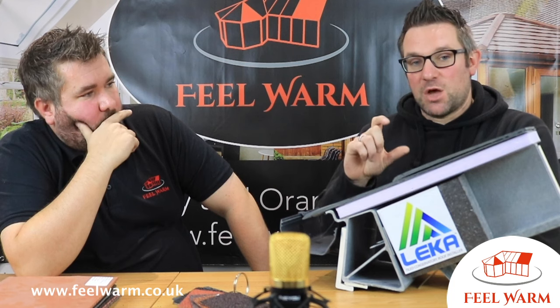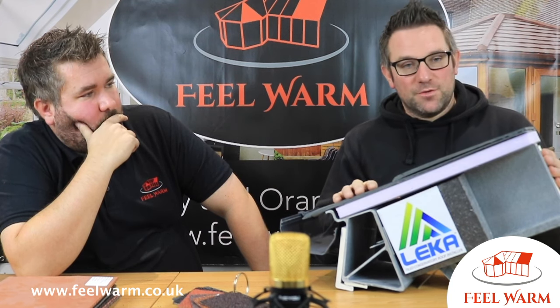So what you then have to do is beef your timbers up to be quite deep timbers, which, again, are dense material. It needs to be quite dense to take the weight and put the right amount of insulation in between the rafters. So if you've got to get 150 mil of insulation in between a rafter, you've got to use a big six by two timber beam to get in there. So that's really heavy. You imagine a lot of them running through a roof.